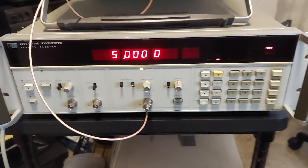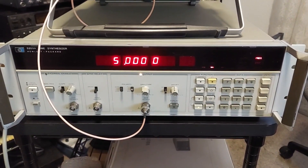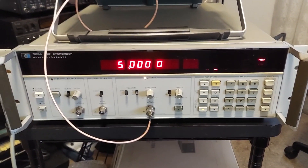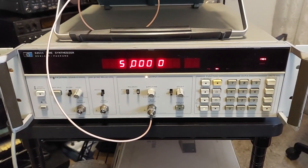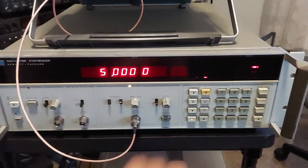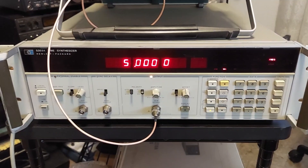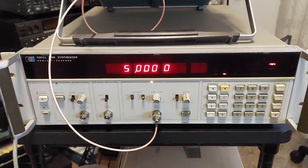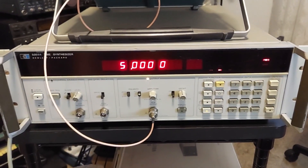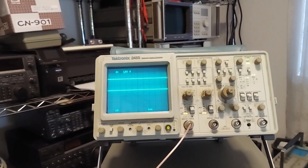When I originally got this, I had a couple of problems. When you power it on, you would get an error 4, which is a PLL unlock error. But you could clear it just using the clear key and the thing appeared to operate just fine. The other issue was that I couldn't run the calibration routine because it was coming up with a 9.1 error, which is a calibration issue. Once I cleared that, I played around a bit more and verified it was operating correctly, including the outputs — we've got two volts peak to peak, as shown on the scope.